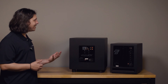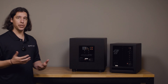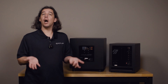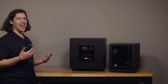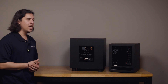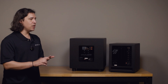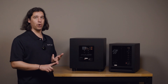In general, we'll often leave our subwoofers in auto mode, which means the subwoofer is only going to turn on when it senses an input signal at any of the inputs that is strong enough to meet its threshold. Try using the sub in auto mode — it should trigger on when it receives a strong enough signal. A piece of advice: if the subwoofer is not triggering on and you feel like you have to send it too strong of a signal, one thing you can do is go into your processor or receiver and boost the level of the signal being sent to the sub.